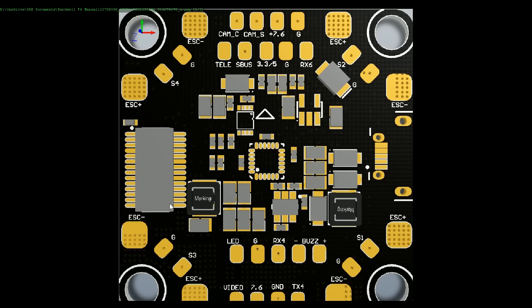If you look at the pad layout, we can talk about the UARTs. We put a lot of work into designing the UARTs so that we could have a clean and concise pad layout without a lot of extra pads that you aren't using, but still give you all the functions you're going to want. The functions we focused on were obviously serial receiver, smart port telemetry, smart audio, and ESC telemetry. Whether you're doing SBUS or a non-inverted protocol like Spektrum Satellite or FlySky iBUS, you can do all four of those functions at the same time.